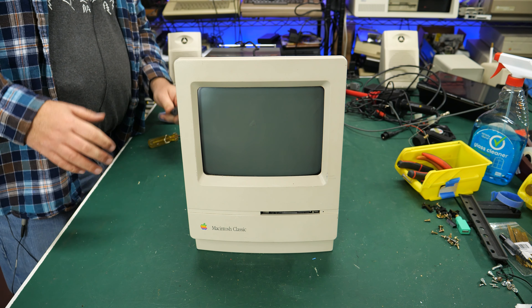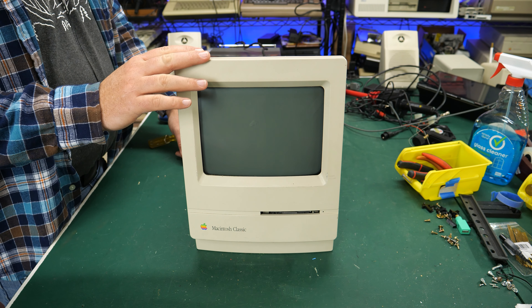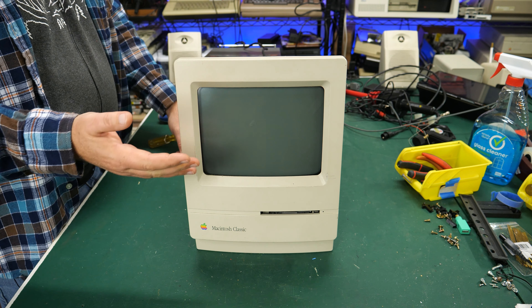I should mention that since this is a CRT, you really should be careful. It's very easy to electrocute yourself — give yourself a really nasty shock with these CRTs that sometimes hold charges. Things are exposed and mains voltages are also somewhat exposed inside this chassis. If you don't know what you're doing electrically, it's probably best to leave this alone until you get some experience. Ask a friend or go to your local makerspace. I'm going to go ahead and plug this in now and we'll see what's going on with this Mac.